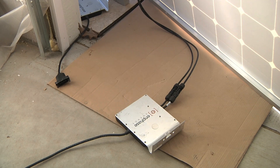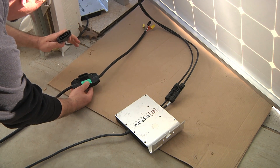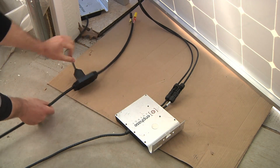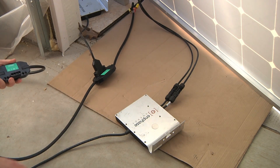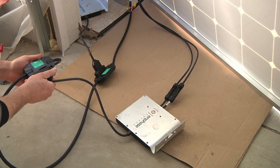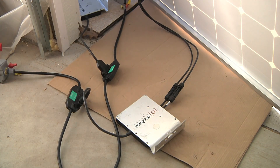Now I've got my solar panels, my inverters, and my test rig cable — all I have to do is plug it all in. The inverters are not going to export energy or do any communication right now. There is an up and a down to these connectors; there's a faint little mark — they're not quite symmetrical. I can feel and hear them click in place when they're working correctly.